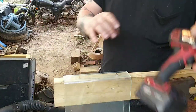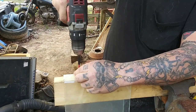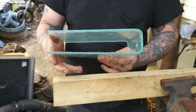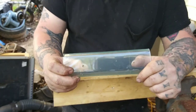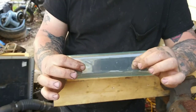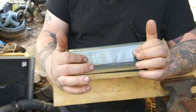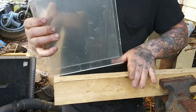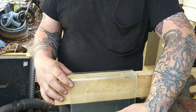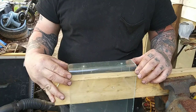Now we'll just take your screws out — these screws are going to be hot since the heat gun warmed them all. Now it's perfectly square. These two holes are also going to be used for white nylon screws from Lowe's. We're going to put those down through the two holes. Say this is the side of your tank — if your weir is too low, with those nylon screws you put them through and as you screw them down, it pulls your weir up out of the water so you can adjust your water level.